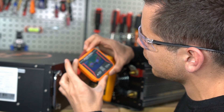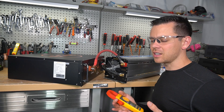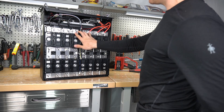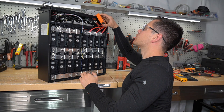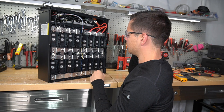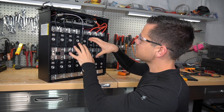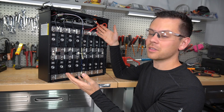The hottest temperature is 127°F on one battery and 125°F on the other. We're going to open the battery up to see what's inside. It's a large low-voltage battery — I can touch any of it with no risk of shock. The BMS is hot at 154°F maximum. The terminals and bus bars look great with no hot spots and a pretty uniform heat distribution. This is a very different design than their 48 volt server rack batteries, with a higher current BMS to handle double the current.